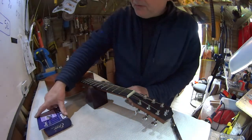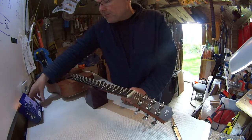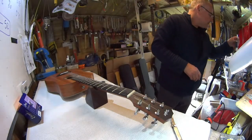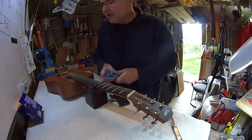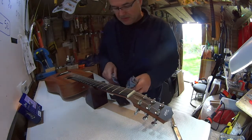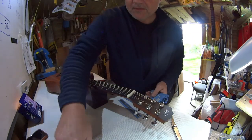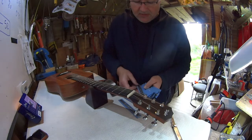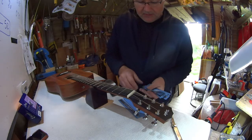I'll take my reading off the diameters, or the gauge, because I'd like to cut larger or bigger than the actual gauge anyway, so that we don't get any binding. So if we're 12 for the first, then I want to go to 13 at least, probably a bit more if I'm honest. 12, 13, 16, 17 is too little, so 24 at the next jump.